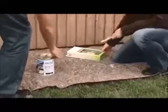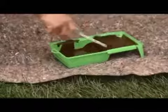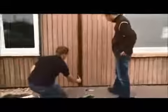Once you've decided on a colour tone, we recommend trialling a sample on a small section of your wood so that you're happy with the appearance. For this project, we decided to use Osmo Natural Oil Wood Stain 708 Teak. Stir well before application. Here we are using the Osmo roller and brush set — the brush has high quality natural bristles, the tray has disposable plastic inserts, and the roller has microfiber fabric for easy application. Apply thinly along the direction of the grain and spread well, avoiding any roller or brush marks. The small brush is ideal for any grooves within the structure.